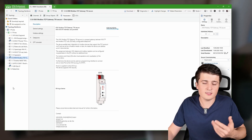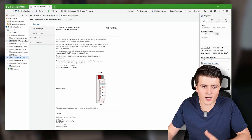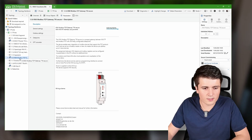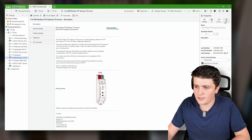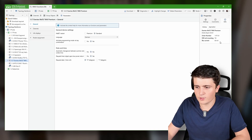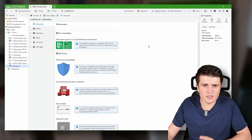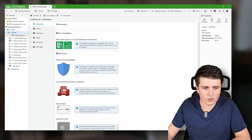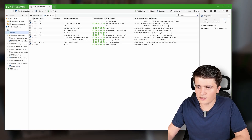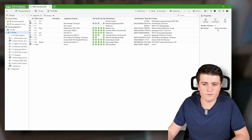What you need is the ETS. Set up your KNX installation in ETS — add all the devices you want on the KNX line without programming them. For example, clicking into the ModBus TCP gateway shows it needs 20mA, the push button here shows 60mA, and the Gira S1 only 2.5mA. You can also click on the twisted pair line and see the estimated bus current — in this case, 138.5mA.